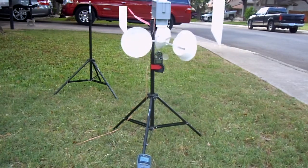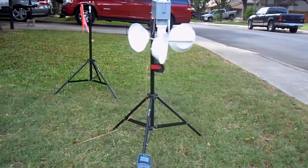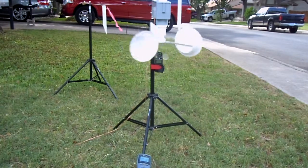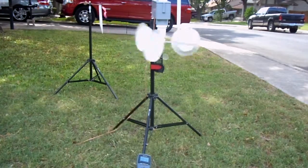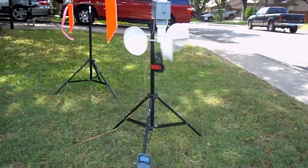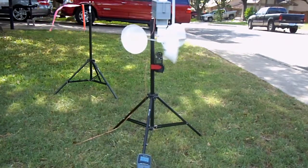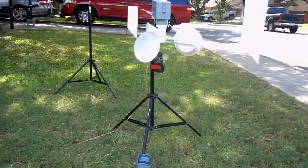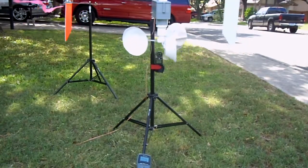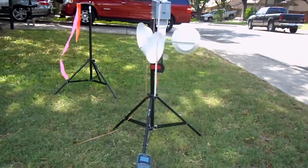So the voltage is actually directly related to what the bullet deflection would be on the target. In other words, the angle change near the null, which would be the lowest voltage setting, will have the maximum rate of change. When the vane swings to 90 degrees, it has very little rate of change as far as angle, but it allows the maximum voltage coming off the anemometer.